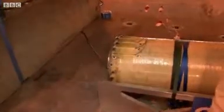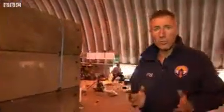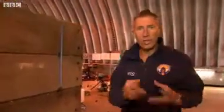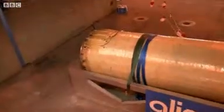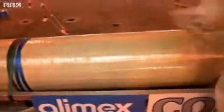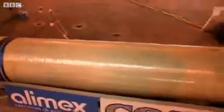When the hydrogen peroxide arrives here, it will go into an 80-layer silver oxide catalyst pack. It's forced through. That's the largest silver oxide catalyst pack in the world. It will split down the hydrogen peroxide molecules into their constituent parts of water and oxygen at 600 centigrade. That superheated oxygen will then finish up coming down the center of this tube, which has 180 kilograms of hydroxyl terminated polybutadiene, i.e. solid rubber fuel.